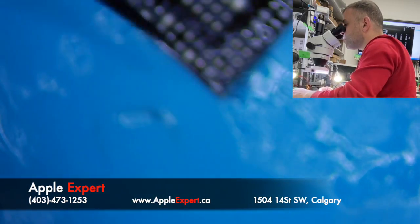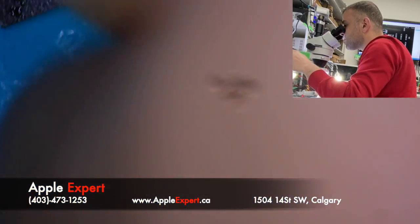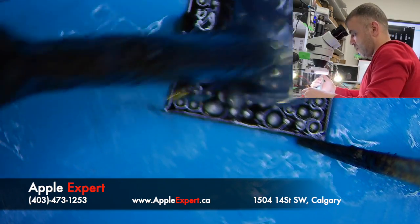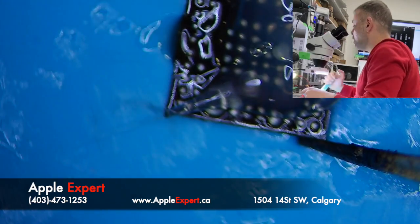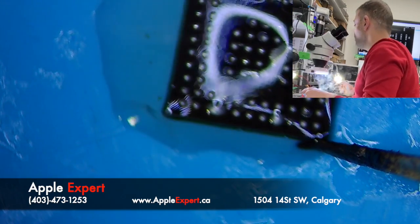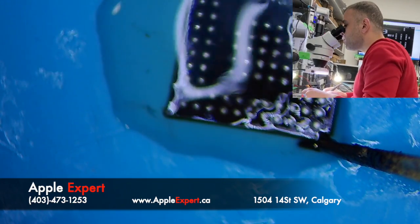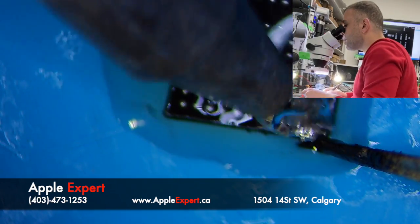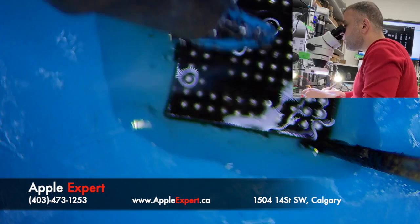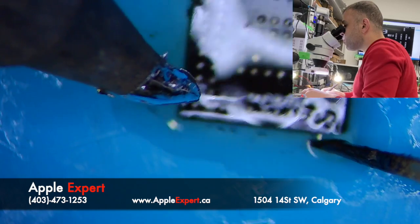Let's check it under microscope. The CD3215C. I'm just going to tin it. As I told you, later on I have to do a proper reball. Why am I doing it this way? Because I don't have a new chip and there is no time to reball it now. Again, this is not the proper thing to do. I have to do it so I don't waste time with reballing. Because I want them to connect.